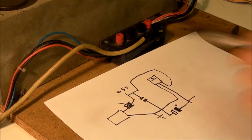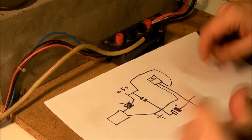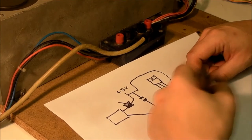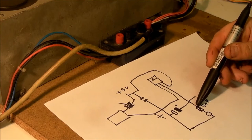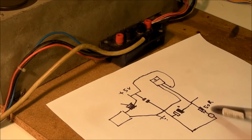Additionally, if you like, you can take that LED and put a 50 ohm resistor in series, then connect the LED to ground. That means when you switch the circuit on into RGB mode, you get a little visual indication that it's in RGB mode by the LED lighting up. Like I said, it's not essential, but I did it on mine. You can build the circuit and omit that bit, or if you want the visual indication you can add it.